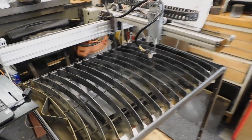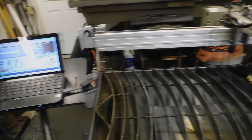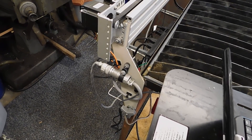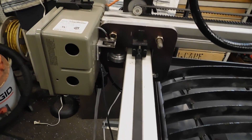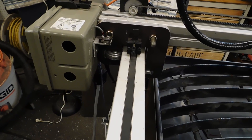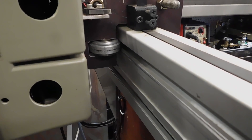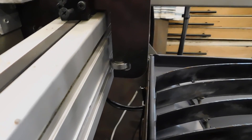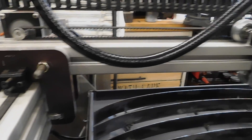The Y and Z axes hang in free air over the table. There's nothing on either side so you can put quite a large sheet — a sheet that's significantly larger than the table. The laptop mount is removable so if you had a very large sheet you could take that off. I cut some brackets out of quarter inch steel to hold the 45 by 90 extrusion on the back of the cart. And then I milled these half inch aluminum plates — half inch is probably overkill but it is the size that I had. They hold a pair of beveled wheels that fit into the groove in the extrusion, and then there's a simple bearing — these are skate bearings that ride on the flat portion in the front. That's what supports the Y axis.